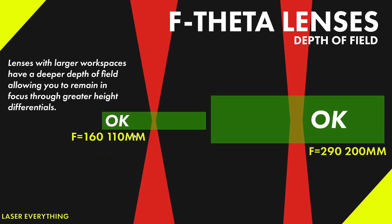Now for this video, I'm using my 300 millimeter lens, which is the biggest one you could reasonably use. They make larger lenses, but they're kind of hard to find and they require special towers. Any amount of depth of field you can add to get further around the curve is going to help you in this situation. So not only does using a larger lens give us a lower power density — meaning we're less likely to ablate the metal while removing the coating — it also gives us a greater depth of field, which means we can go further around the curve without actually marking the metal. These are two really key concepts when we're trying to do this kind of work.